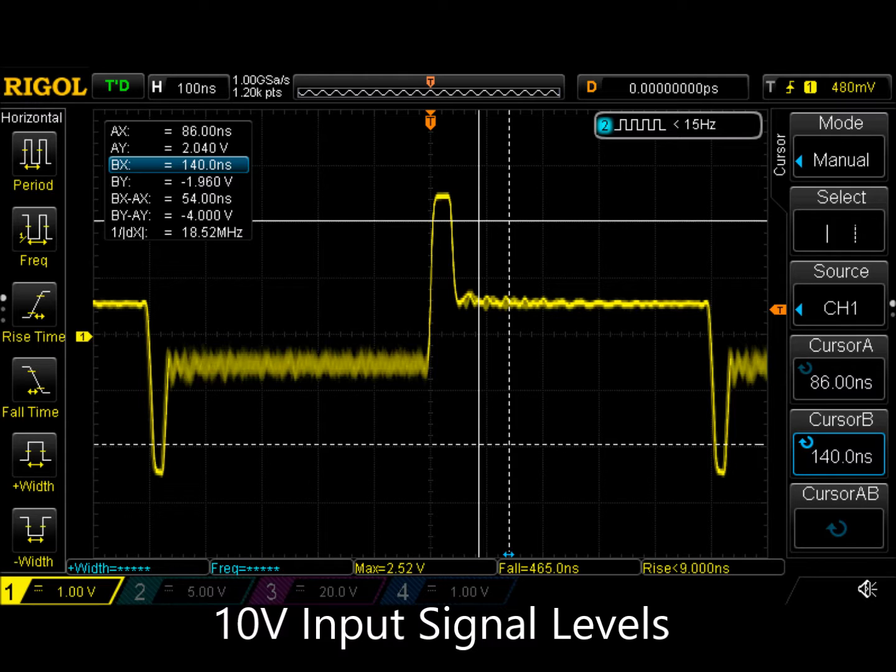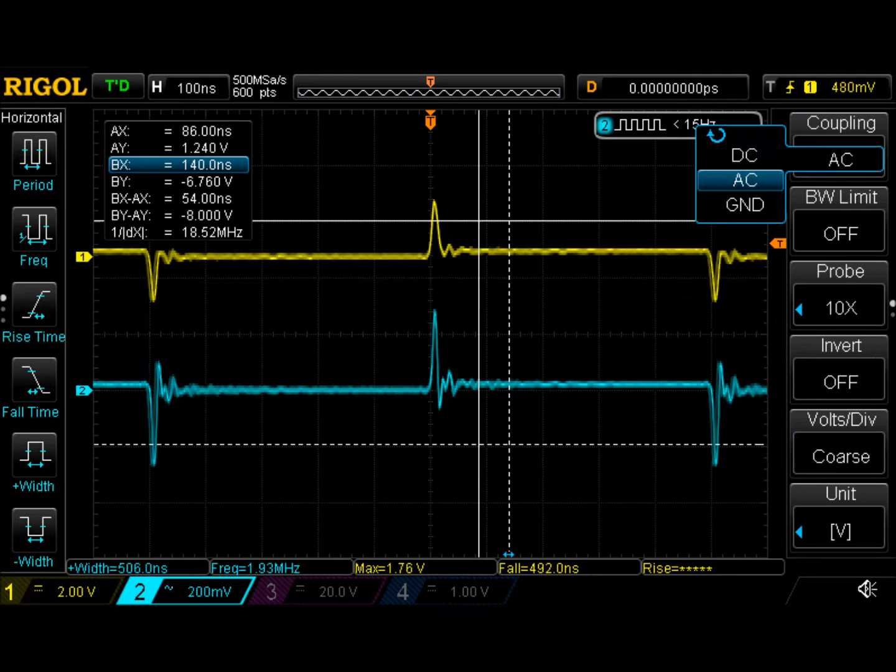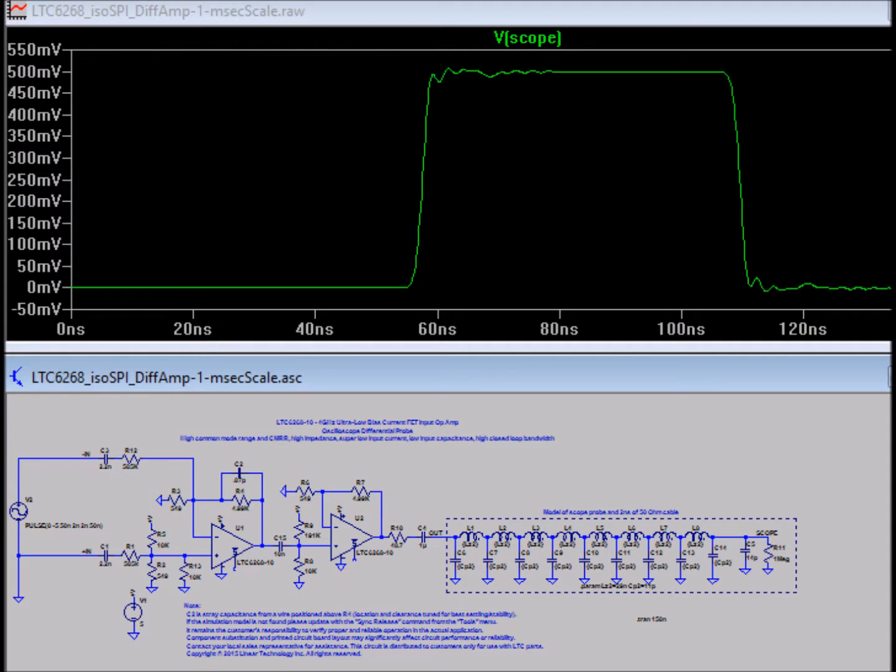This is the real nature of the op amps that are used. Since there are only two op amps here, which of the two is causing that? Looking at the output of the first op amp — the differential one — the yellow at the top is the output of the card and the blue below is the output coupling capacitor between the two stages. So it's coming out of the first stage. The simulation doesn't show anything like that overshoot or undershoot, so I'm not quite sure what's going on.